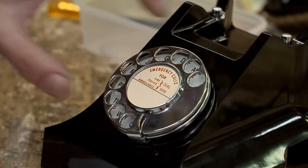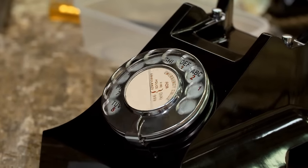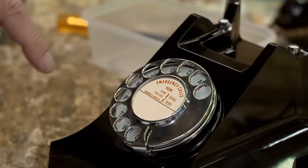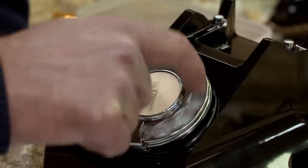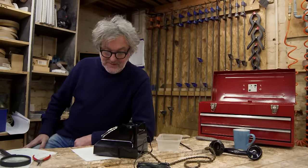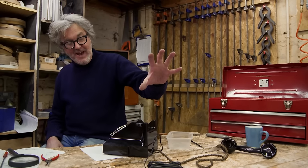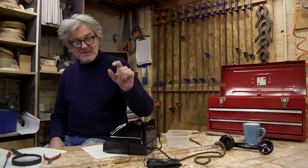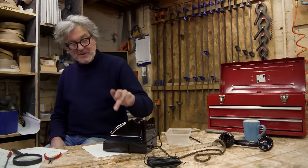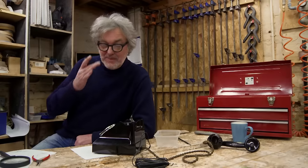The reason is the telephone works by sending a series of pulses down the line. That's three pulses for the number three. The problem with it is telephone exchanges would take a while to wake up. They couldn't wake up with just a one. They needed a big number like zero, which is why most telephone numbers began with a zero. And that's one problem. The other problem is that the early telephone lines were suspended through the air, and if they touched each other, that sent a pulse down the line. And on windy days, they would occasionally touch, and you'd get a single pulse down the line. And there was a very good chance that you could get three of those in succession, which would give you 111. And if you'd made 111 the emergency dialing number, that would happen by accident all the time.